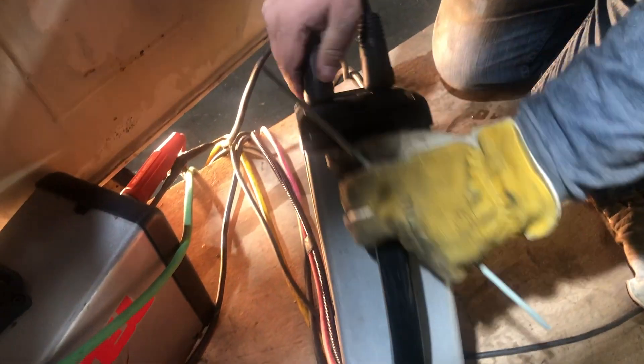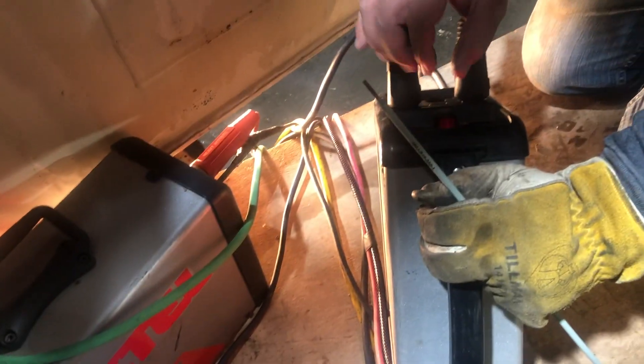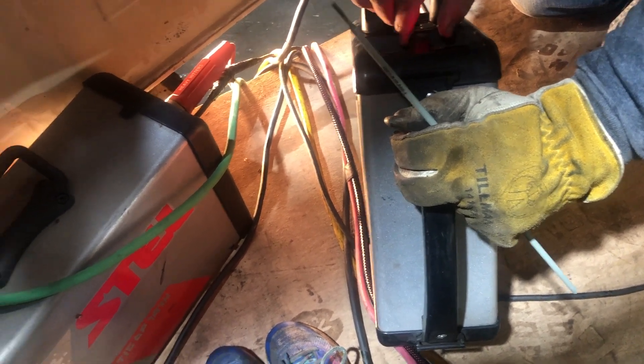From here on forward it's stick welding — Brutus rod from Rock Mount, eighth-inch diameter. The literature says something like 95 amps; that's where I started, then I ended up at about 105 and felt it ran better. I switched the ground cable from the TIG machine to the stick machine and welded everything out. I tried some pulse, tried some without — initially pulse was okay but on that stainless you do need a fair share of arc and heat to make the weld good. It runs cooler than a 7018 anyway, with better strength and better elongation.